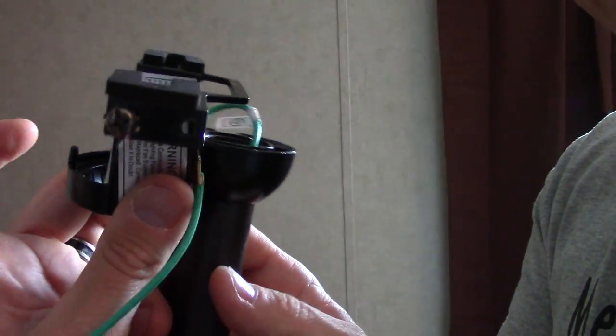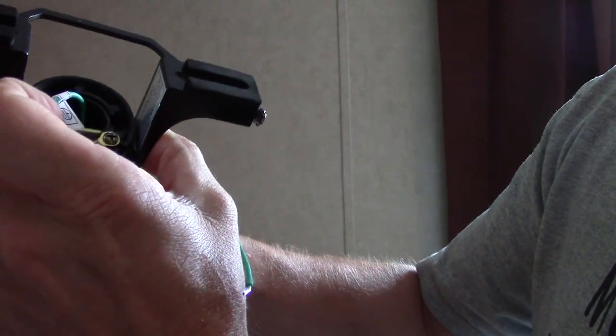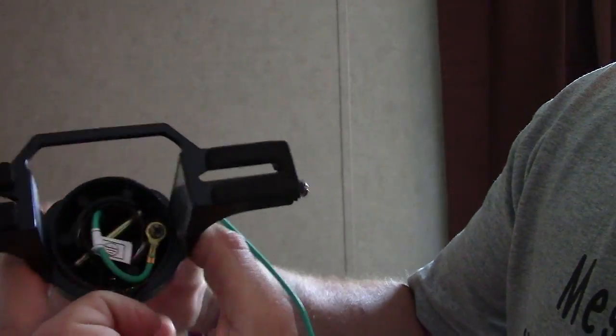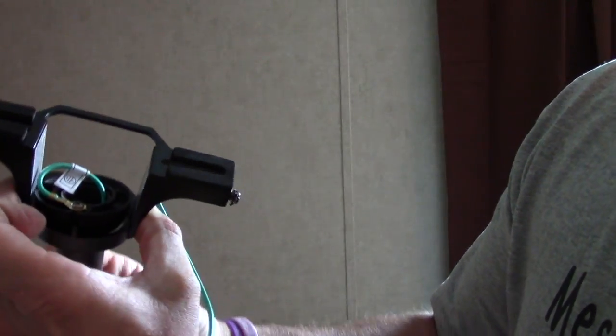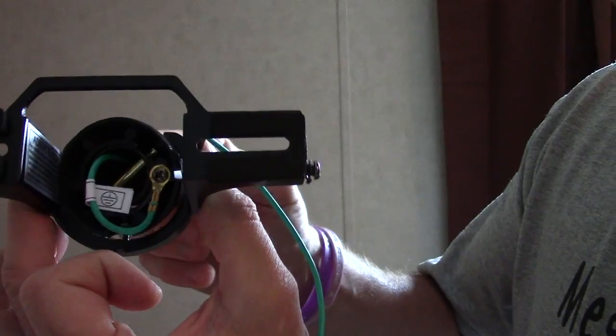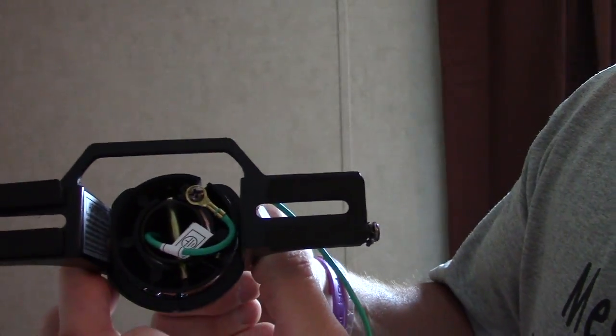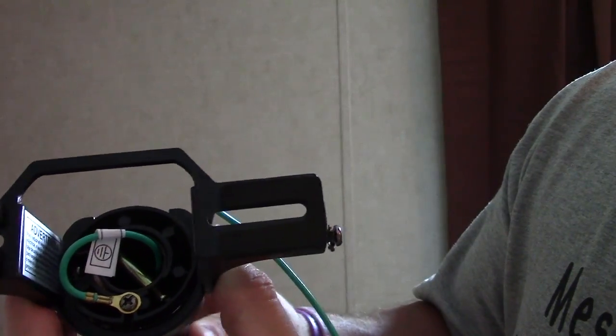Let me show you this on the mounting bracket — the way it looks on your ball. See how that little groove is right there? When you slide this in here, that's got to lock into that. If you don't lock it in there then your fan will be all over the place. When you put the ceiling fan in there all you've got to do is rotate it and you'll feel it click — and that keeps your fan stable.